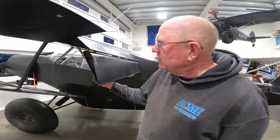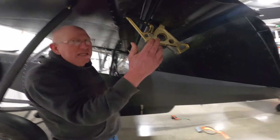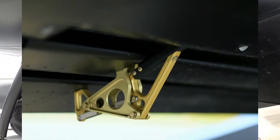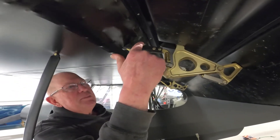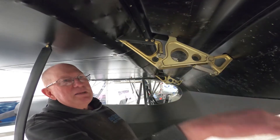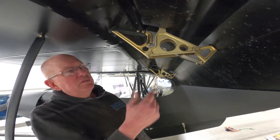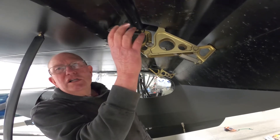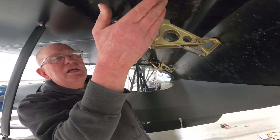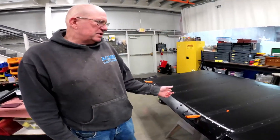The way they do that is — if you come around to the front of the wing — they have this mechanism that was designed and beefed up on the flap hanger. It has all the geometry that gets the double-slotted flap to go down and make all this work. We'll step over to another wing and talk about the geometry and the beef-ups needed to make the double-slotted flap structurally work.